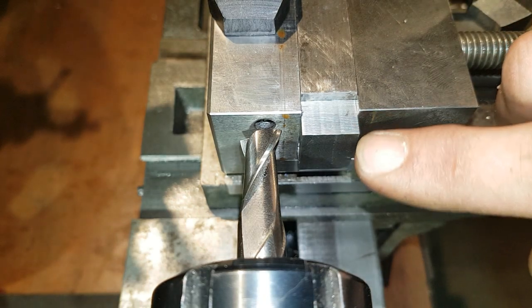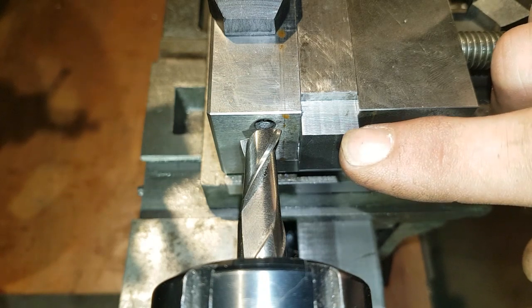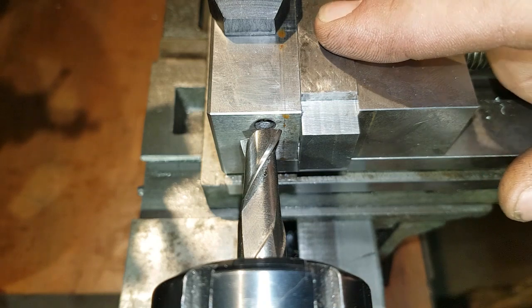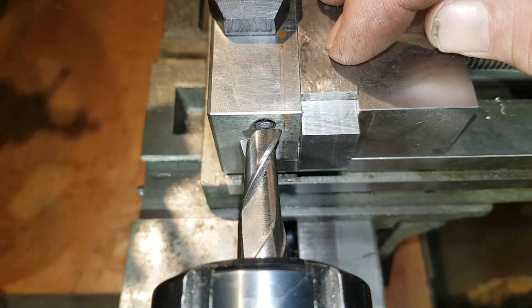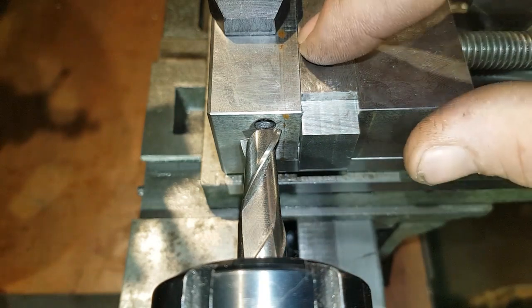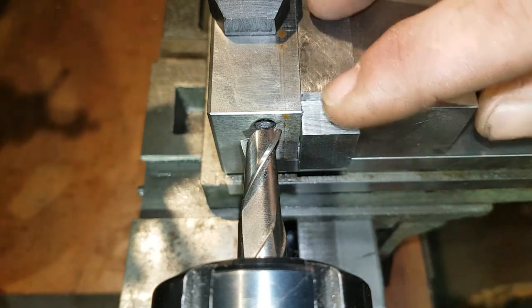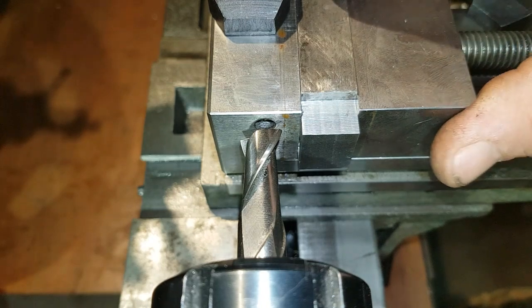I need to take off a small amount from the side here in order to fit the slots in the face mill. I've got a small parallel setup here with a drill bit in one of the holes that prevents it going any further. So yes, that's my stop, and then I'm using that to square up the piece in the jaws. It's ever so slightly smaller than that, but the jaws bite down onto both of them, so this is definitely held in place and this one's not going anywhere either.